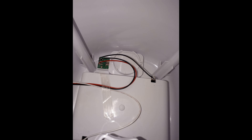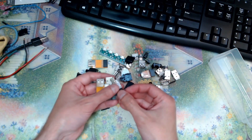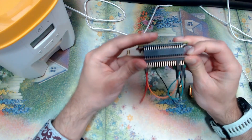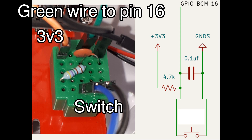If that's not to your liking, there are two alternatives: run a 5V power supply with the right connector through a hole drilled in the back of the feeder, or wire your own USB power connector to the voltage and ground in the feeder — you can find USB breakout boards for micro-B USB (older Pi models) and USB-C (Pi 4 and Pi 5). The motor connects to the motor Pi hat — put the hat on the Pi, secure the motor's wires into the screw terminals, and feed 5V into the controller's power input. The switch drives its output to ground when pressed, so you'll need to drive the Pi's digital input pin high to 3.3V with a pull-up resistor — I use 4.7kΩ.